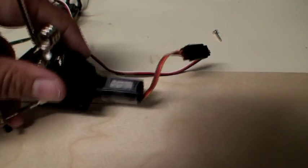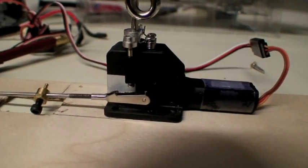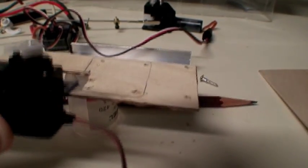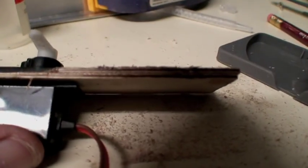I've already learned that the spacing is very critical between where the servo hole will go and this push rod. This needs to be straight. I found when I dropped the servo in from the top that it was too high for the steering push rod. What a good friend recommended was to bring it up from the bottom, and I'm using another piece of one-sixteenth plywood that I cut out here. I'm going to glue this together to give myself a little more elevation from the bottom. So this now is the servo coming up from the bottom — two pieces of plywood epoxied together. Ideally, if everything works, this will go here.